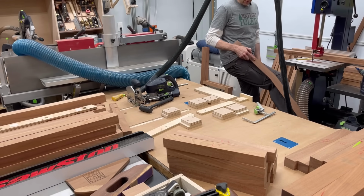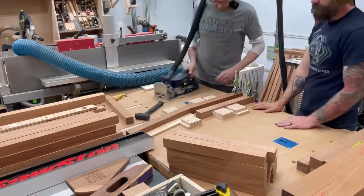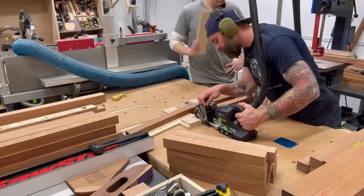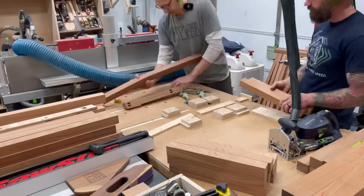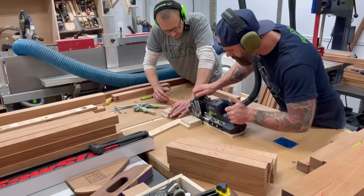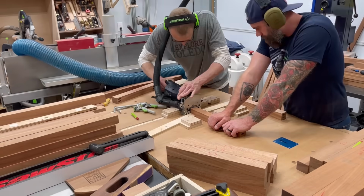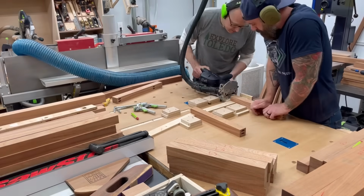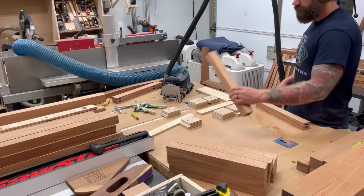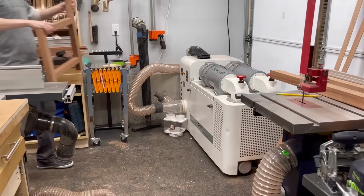So with our jig all figured out, me and Keith got to work mortising out all of our pieces. Keith would do one side, then hop the domino joiner over to me, and I would do the other side. We'd drill first with the domino joiner flat to the outfeed table, then plop a piece of 3/8 inch plywood to raise it up and drill again, giving us 2 perfectly mortised out holes for 2 sets of dominoes side by side. And in no time, all of our leg pieces were drilled out and ready to hook together.